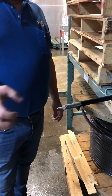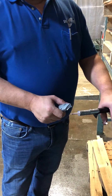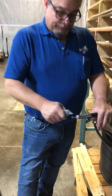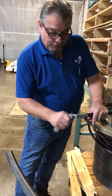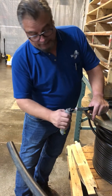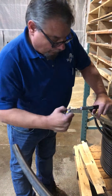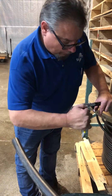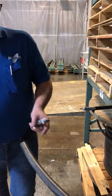Pull that off. Normally you would use a plastic clothespin-type tool to peel this off — we don't have that at the moment, so we're going to use a knife. You don't want to dig into the copper; you really don't want to use a knife at all, but if you don't have a gator, you can use a knife to scrape the dielectric off. Make sure you get it all off — nice and shiny — so it makes a good connection. I've taken some apart where that's been the problem: there was still dielectric on it.